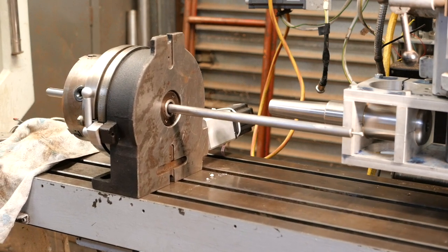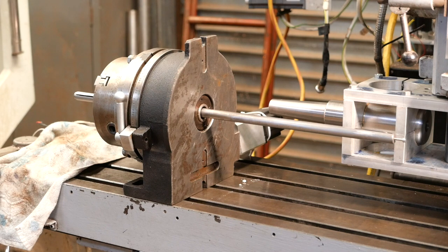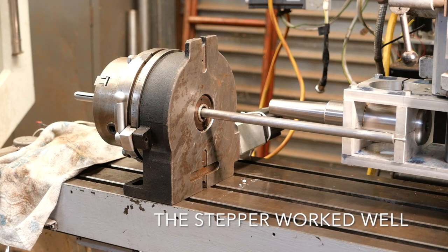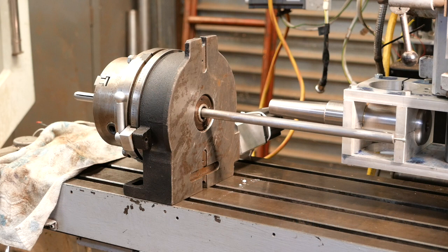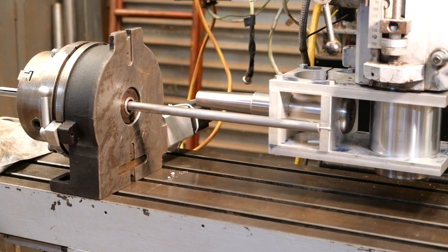That's the theory, and the next video I make hopefully will be showing this in action. I've got a few question marks about this whole setup. One is that the stepper motor running the rotary axis table is only a NEMA 24, which might be a little bit underpowered to do the twisting action — but I think it is a 1-in-60 or 1-in-90 ratio rotary table so it's geared well down. The other concern is how the high-speed steel cutter is going to cope with cutting the grooves. I fully expect to have to sharpen it every couple of cuts, but we'll have to see how that goes. Wish me luck for doing the real thing.